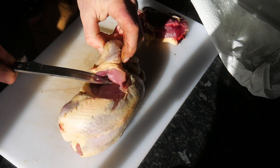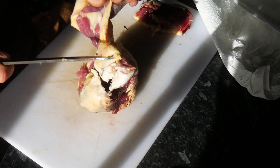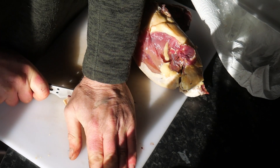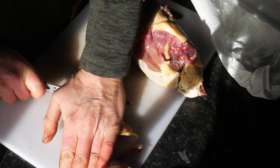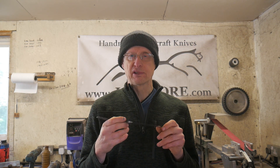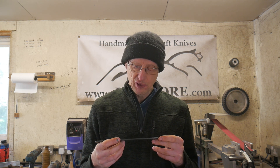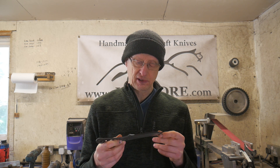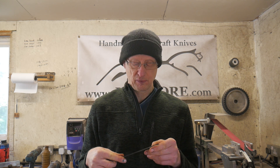It was quite a zero grind, which isn't the strongest. On the wood there was absolutely no damage — the edge held up very well, and the dog food chopping held very well. It was only batting it through the leg bone that took the first tiny little chip out. The other damage was done by dropping the knife multiple times onto concrete from about a metre and a half — five to six feet off the ground. And even as it is now, this knife could be restored literally in five minutes on the grinder, though by hand it will take quite a bit longer.